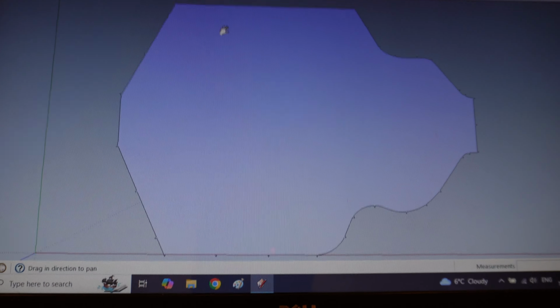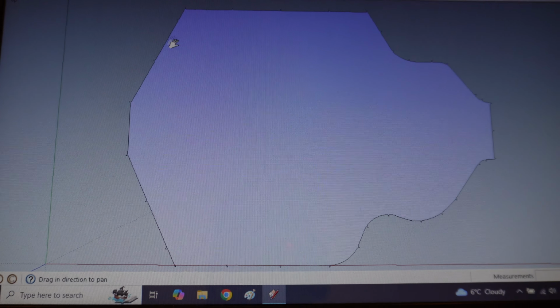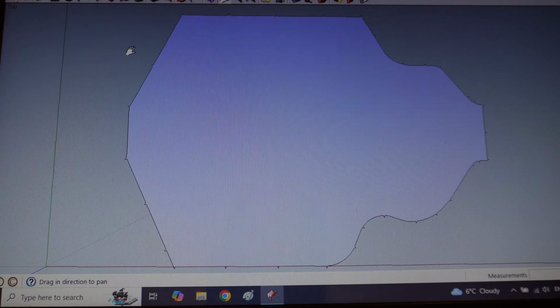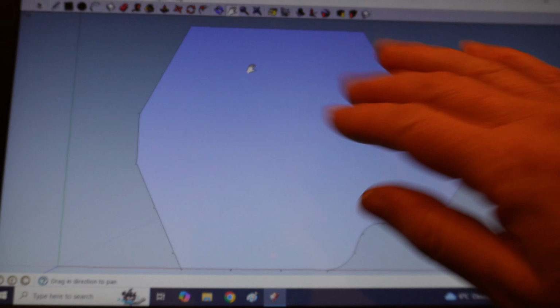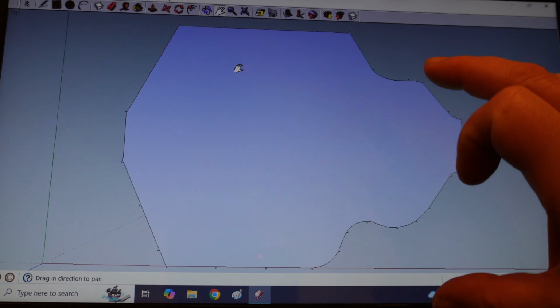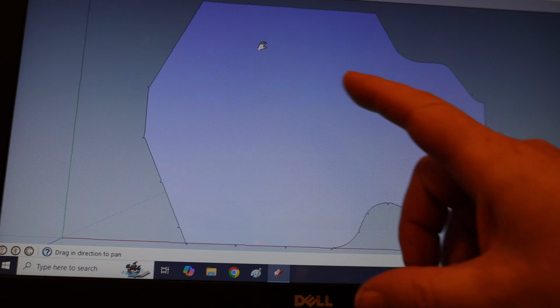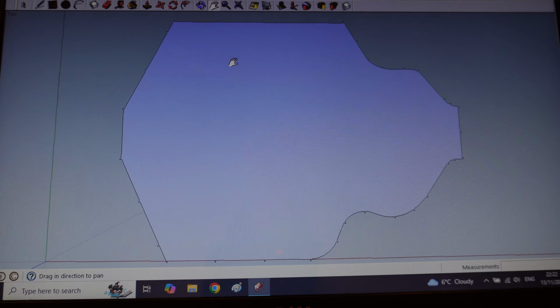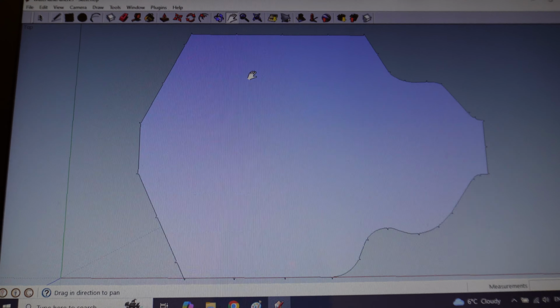But if I'm having this laser cut, to do this by hand, you could do it, but it'd be pretty tedious. But because I'm going to kind of cheat and have it laser cut, because there's a company near me that laser cut me bits of metal for other projects, you can put funny little spikes all the way around. The laser cutter really doesn't care, it'll just do it. So I've got two panels like that, and I've got 19.5mm wide strips, if you like, which I've got to weld in all the way around. Then I've got to put a filler cap on the top, and then I've got to have the pipes for the various ports. So yeah, I'll probably tape it together initially once it's laser cut, and test fit it again before I start any welding at all.